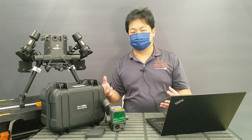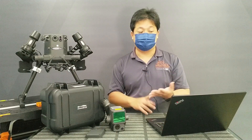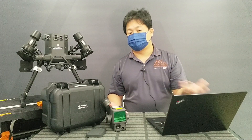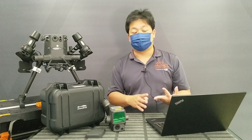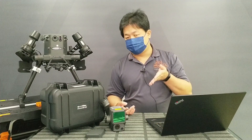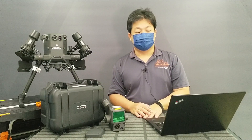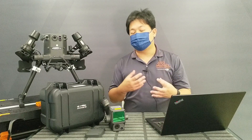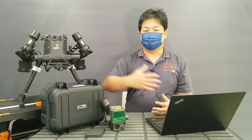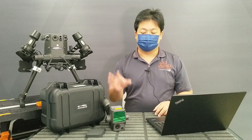It's for those who want hassle-free LIDAR mapping — just buy it, plug it in, and start getting data. It's for corridor surveys, especially power line and pipeline inspectors. For forestry management it's simple enough that you can figure out tree trunk size, canopy size, and canopy heights without needing absolute precision. Pipeline surveyors can check corridor vegetation encroachment. For search and rescue: the vegetation penetration capability lets you see features underneath canopy, and you can work at night — fly over, get terrain data, and work out where crevasses or valleys are to plan your rescue route.